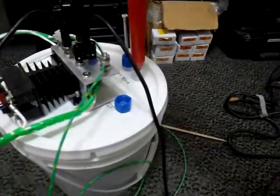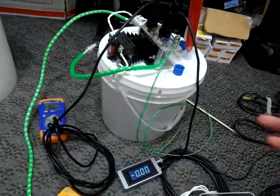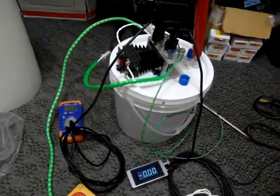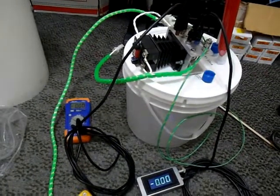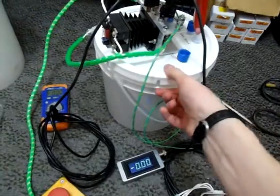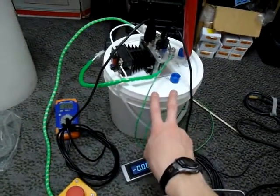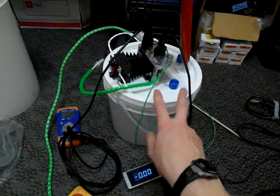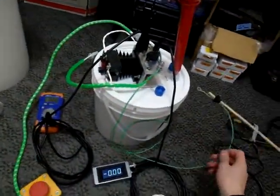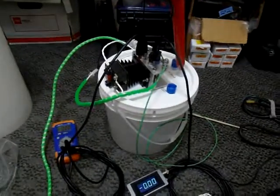The output of the system runs through a bridge rectifier. These diode strings — the X-ray transformer is configured with two secondary windings that are center tapped and connected in anti-parallel. These will generate plus or minus 50 kV simultaneously, so at 50 kV output that would be 100 kilovolts across the diodes. The diodes in here are rated at 150 kilovolts and 15 milliamps. Since this is a center tap transformer, each pair of diodes in the rectifier is only conducting half of the time, so the diodes would be rated at a maximum of 30 milliamps. The X-ray transformer should not be run at this high current level.